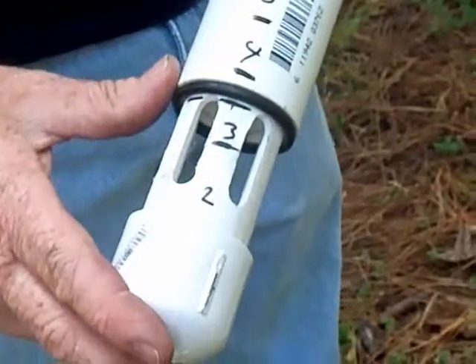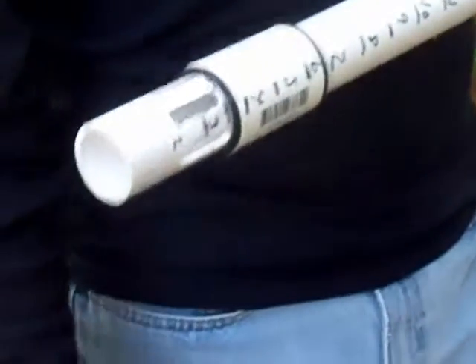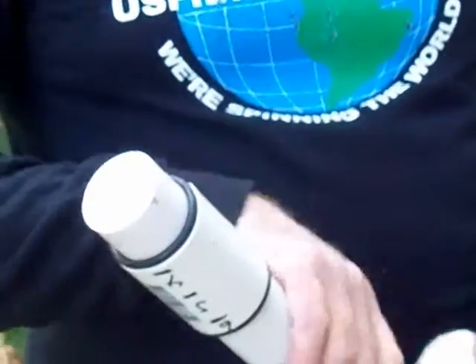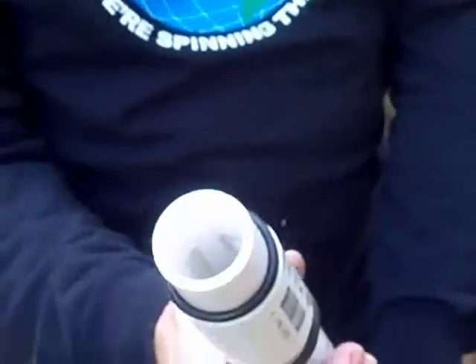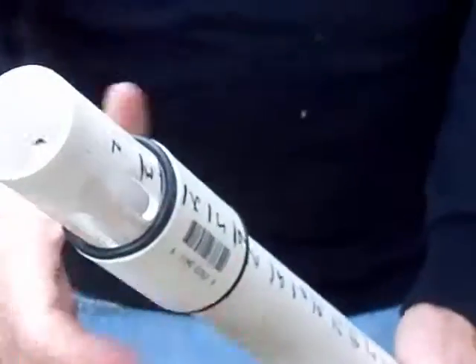We also have a sleeve on this if you want to suck all the way to the bottom of the tank. You just roll the O-ring down and slide the pipe sleeve down. Now you can suck all the way to the bottom because those ports are closed off. If you want to go back, obviously it's the reverse — just roll that O-ring back, put your pipe cap back on. Now you're not sucking water and dirt off the bottom.